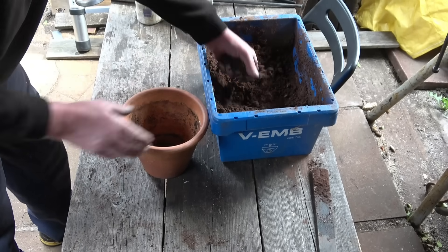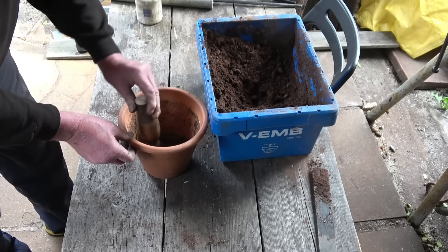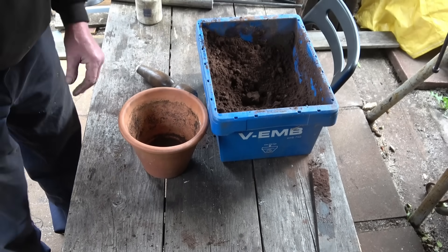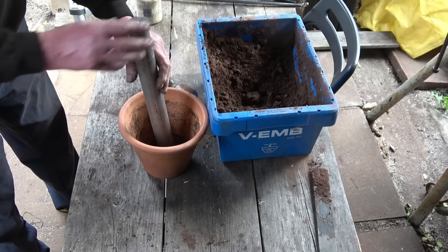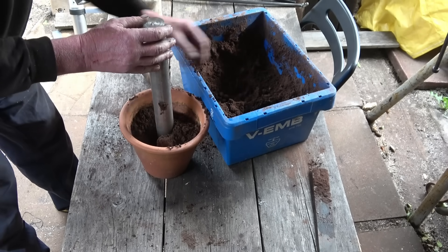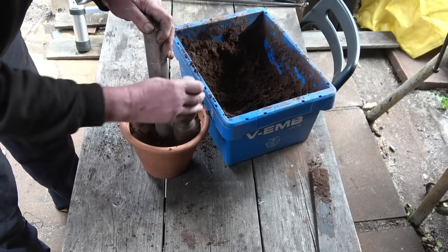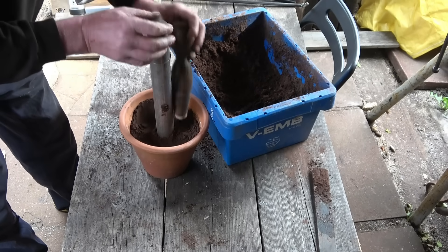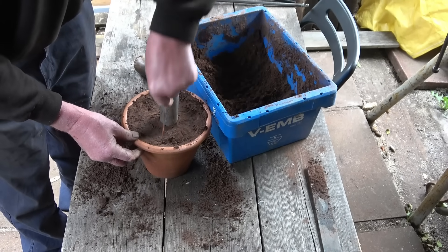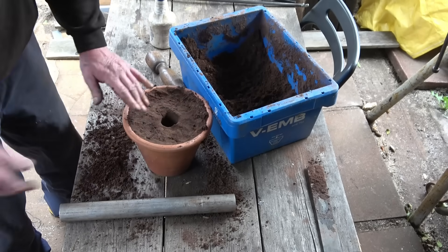All I want to do is cast some scrap bronze into a piece of bar. I've got some green sand here - I know this sounds odd, it's red - but green sand means it's tempered with water. I've had this sand for years, you just keep reusing it. I'm using a plant pot as a flask because I haven't got any casting flask left, and the plant pot obviously won't burn. All we'll do is ram the sand down around the pattern and put some vent holes in the sand just to let the steam escape. So basically we're going to pour molten bronze in there and hopefully get a piece of usable bronze stock.